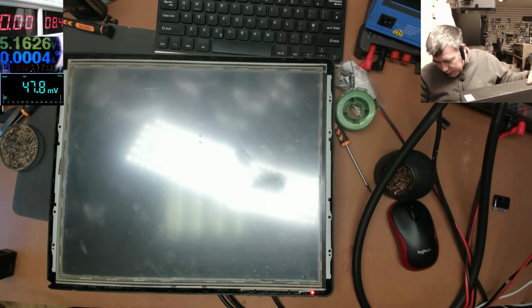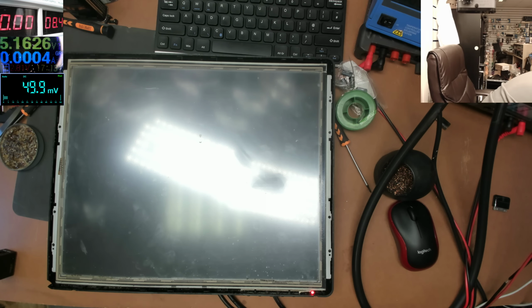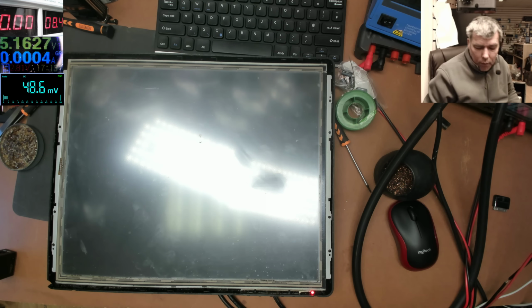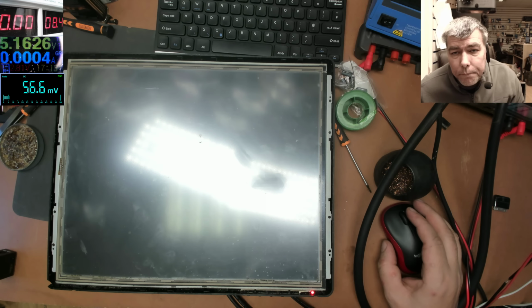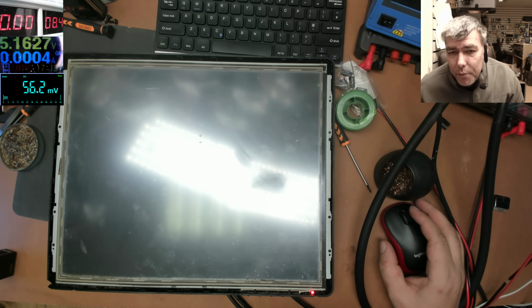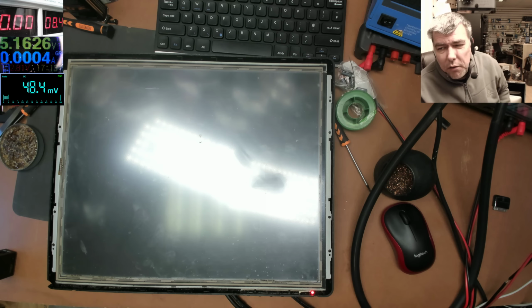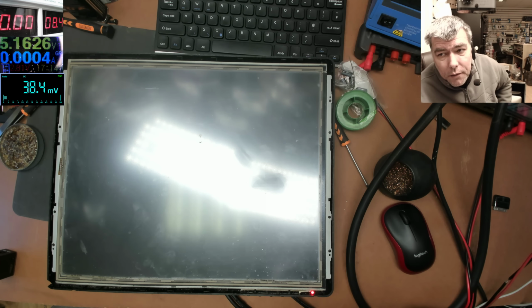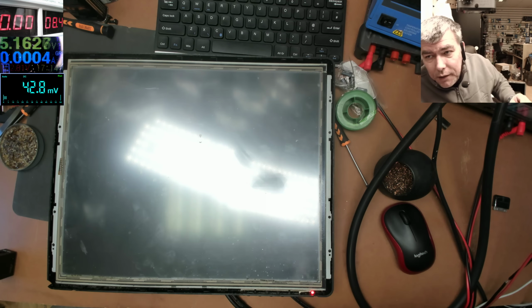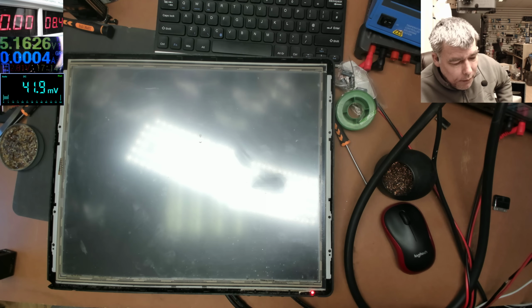Yeah, obviously we have to reconsider the price. Because it was not such a big deal. But yeah, keep in mind. Like 50% of these old things, TVs, monitors, a lot of motherboards, have blown capacitors. Keep in mind and pay attention to the capacitors. If it has a bump, it's gone. So the internal resistance is very high.